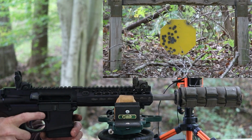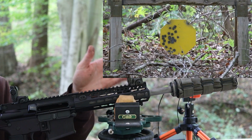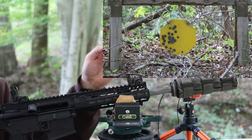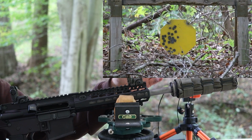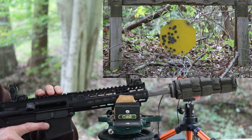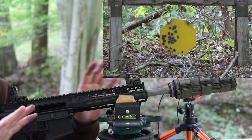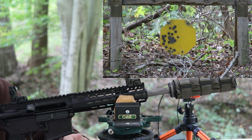Not sure why I kept missing, but the gun ran good. So the picture I'm seeing right now is every subsonic runs with the gas block at 5 clicks or more. And all of the supers definitely ran good from 10 and down. The messing around we did at 13 and 14 clicks and the trigger reset issues, we never saw any of that when we were at 10. So 5 to 10, still a nice, big, wide, good area if you ask me.